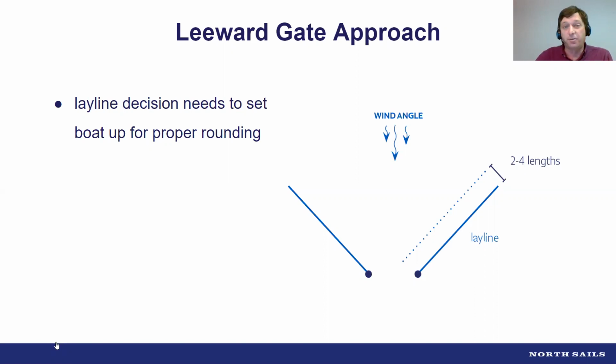If you're sailing a boat like a Marstrom 32, where the spinnaker is pretty flat and furls up nicely, it's not that hard to get those down. If you're sailing a Corsair 28, especially once you're sailing 10 or 12 knots or more, you're going to need several boat lengths to be able to bear away and head the boat dead downwind to unload the sail and be able to get it in.